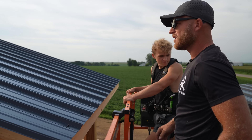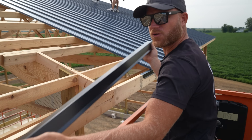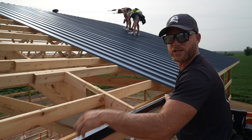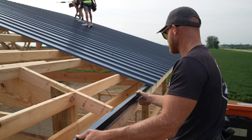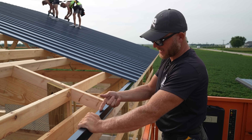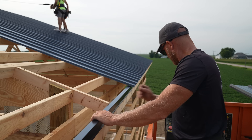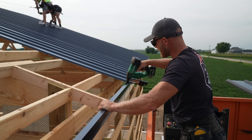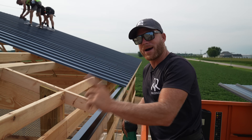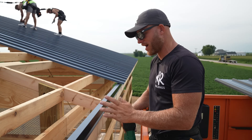While I go on the lift, the boys are going ahead screwing while I prep the next section of roof. It's always the same process — I've got my drip edge. This is a custom drip edge that sits exactly on top of the two-by and then comes down an inch and a half with this drip, and this is where the gutter is going to get tucked under. My gutter guy Scotty hates this trim because when he comes up and puts his gutter in, we do these in one piece up to 80 feet, so he might two-piece this roof since it's 82 feet.